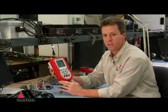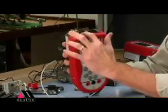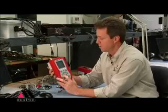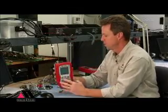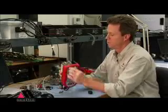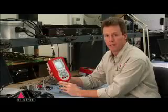If you need to change the unit of measure, press the function key and then the sensor bay location number that you need, and you can adjust any of 11 different pressure units on a pressure module. To install additional modules, simply turn the unit off, drop the new module in, and once again it will read and pick that up.